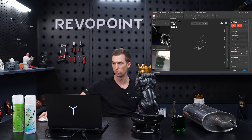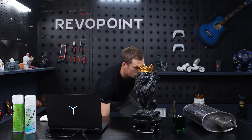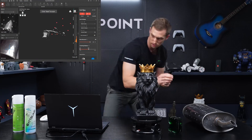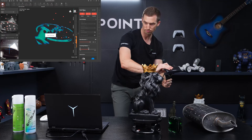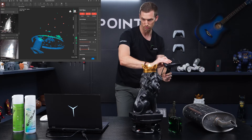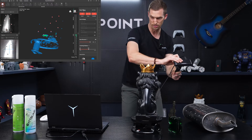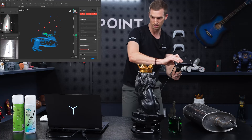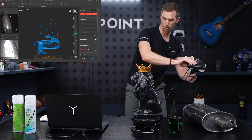That can be fixed with some scan spray. When we switch over to the muffler, let me change this to marker mode and marker tracking. We'll still have some difficulty — even with the marker dots on there, it's still going to be difficult to capture and there are going to be a lot of holes. The preview screen is seeing the marker dots, but we're not really getting the full shape with all the point clouds of the muffler whatsoever.